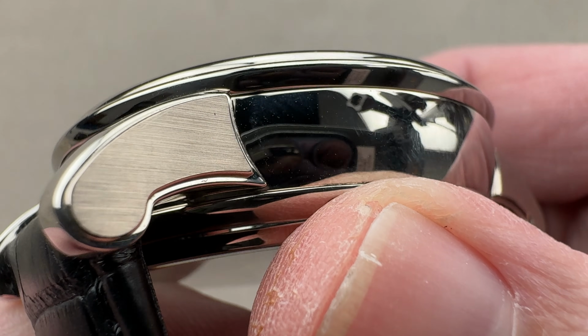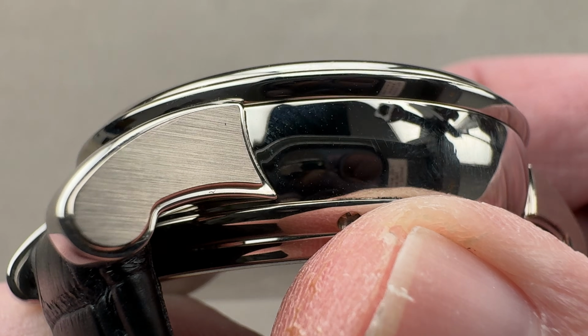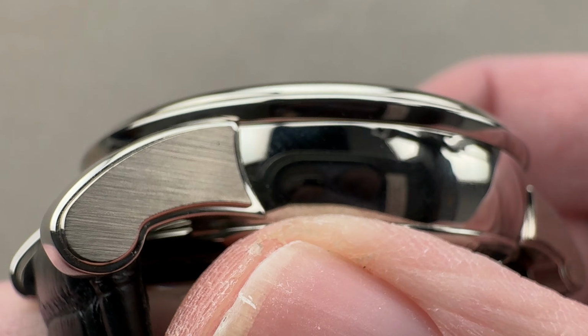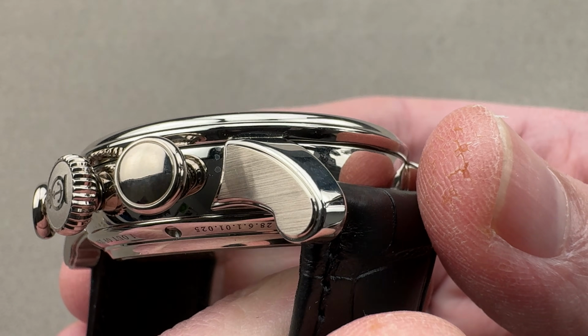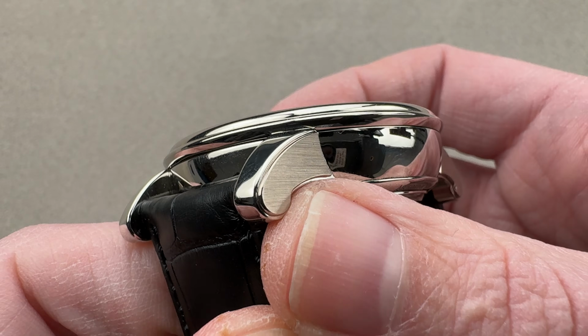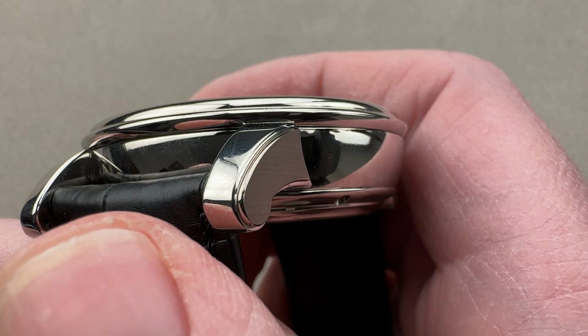As you can see, this is welded lug case construction at its absolute best. The lugs inserted into slots in the case band, welded on carefully, and then filed brilliantly to create an ultra sharp break between the lug and the case band. And then you can see they went one step further and they satinated the outer face of the lug, which is stepped out from the primary lug body.